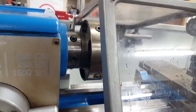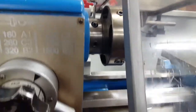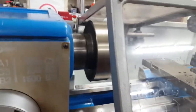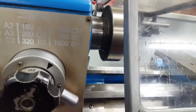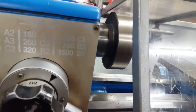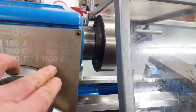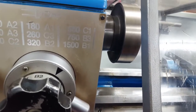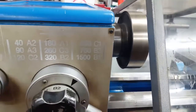Get it back into B — B3 is the 750 range. So what we can do on the 750 range: running at 750 RPM now, we can turn that up to 1000 RPM, so we're bridging the gaps between 750 and 1500, or we can turn it right down, though we may as well just use the other speed settings.